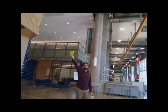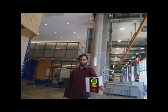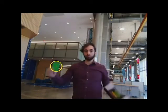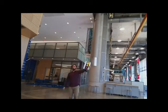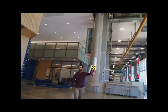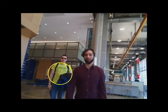Now, remote sensing is everywhere. Anytime you take a picture of something with a camera, you're doing remote sensing. In this case, in addition to remote sensing via a Raspberry Pi camera, we are also employing computer vision, specifically OpenCV implemented on a Raspberry Pi, in order to detect anything green within this frame, and then track it with a yellow circle through the frame. This is an example of passive sensing because we're using ambient light to detect the environment. When we go to take data using a line laser, we're doing active sensing because we are providing the photons that we are measuring. So let's talk a little bit about how we actually built this setup.